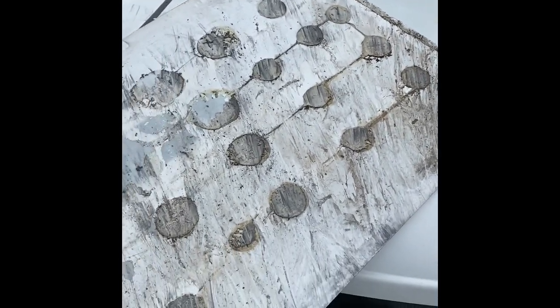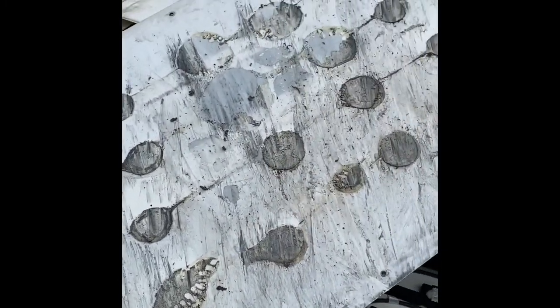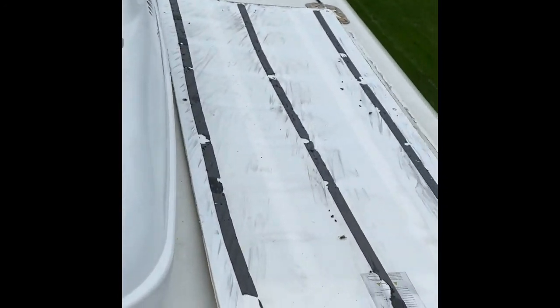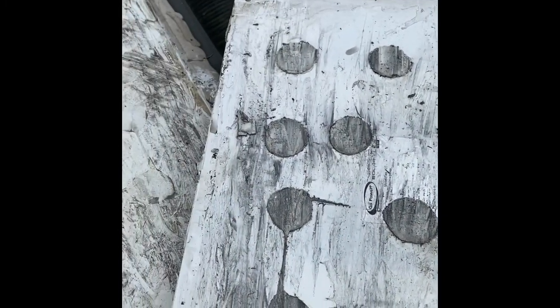Panel number 3 is off. This one took probably twice as long as getting the first 2 off, which were just held on by single strips of what looks like double-sided tape. This one has got dots of adhesive pretty much everywhere, and since no Dicor was around the edges, water was underneath, and so you can see it's pretty filthy.